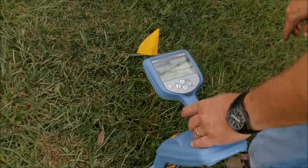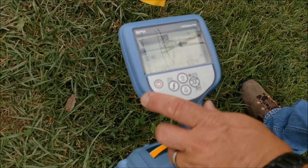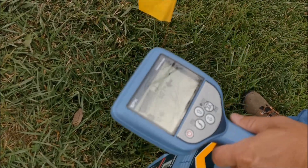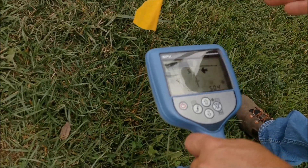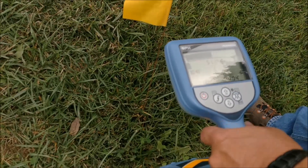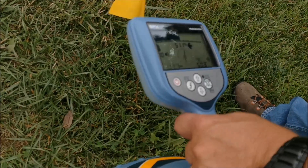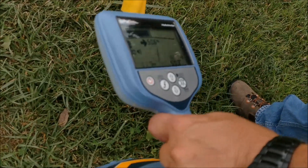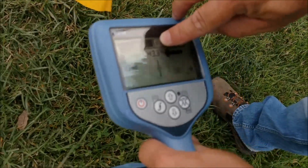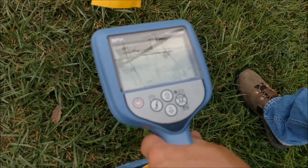Lots of things are going on on the screen, but they're all working automatically. You have your current measurement, your depth measurement, and your compass telling you what direction the line's going — that's magnetizing to the magnetic field you're putting on the line; the current creates a magnetic field and that's what you're locating. The arrows will tell you to go left and right, the numbers tell you where the highest response is, as does the bar graph up on top. You can see the bar going up and down, and wherever it gets its highest response it saves a little tick mark. When you see that line show up, just go back to it and you should be pretty close over the line.